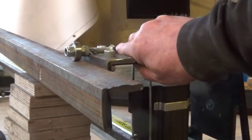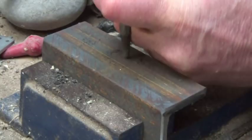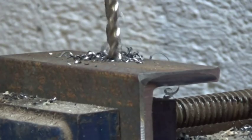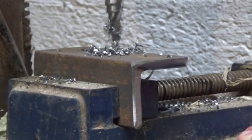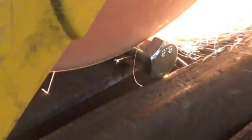It's not even easy to explain the problem, but we did get there, so bear with me and it might become clearer. This is quite interesting. In order to accurately position the bearings, I made an eccentric spacer. I decided eccentric spacers had to be easier to make than regular ones, because having the hole off-center is actually the point of the project and not just a mistake. And so it proved.